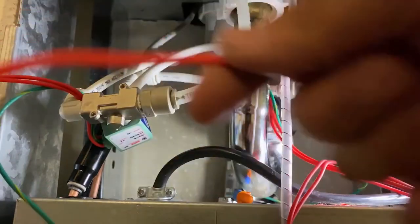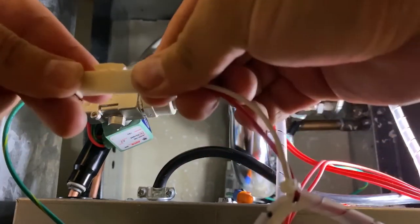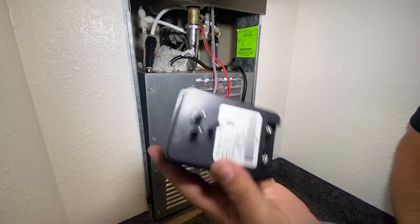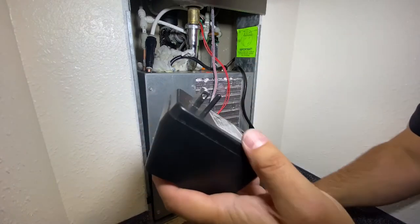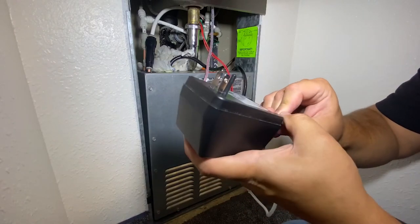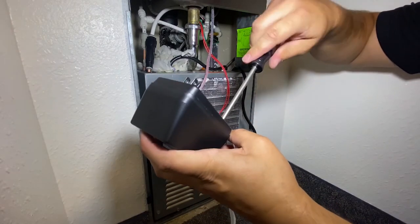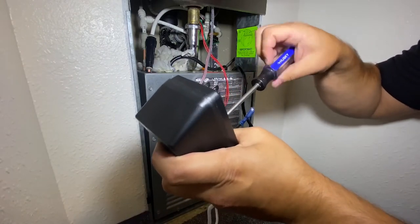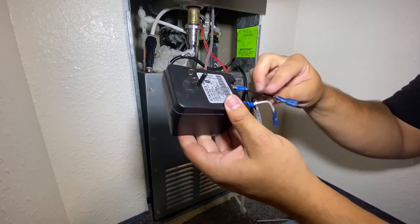Now that the sensor has been wired and installed, it's time to connect the solenoid and the transformer per the cable wiring diagram to the wiring harness. Loosen the terminal screws on the plug-in transformer to attach the wiring harness. The two additional connection options on the wiring harness are for an optional bottle filler or drinking fountain. For the RKHO.120P plug-in transformer kit, plug the 24VAC transformer into a duplex receptacle. For all others, wire the transformer to the appropriate power, either 120 or 240VAC depending on the transformer kit choice.